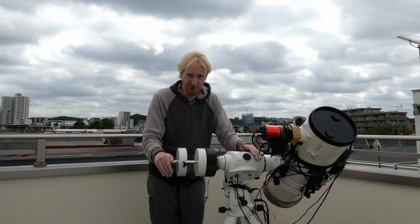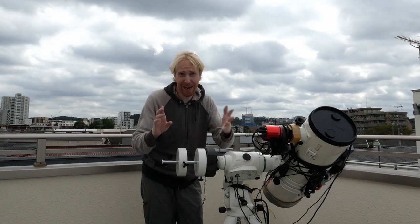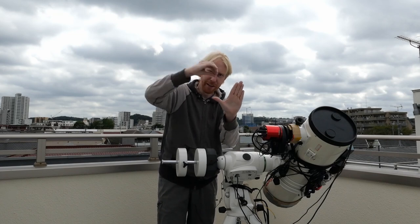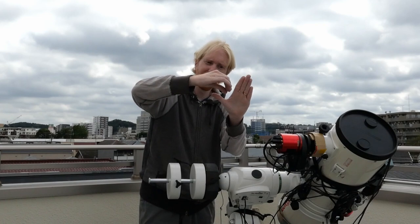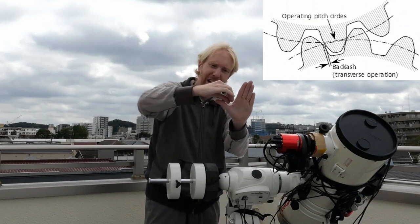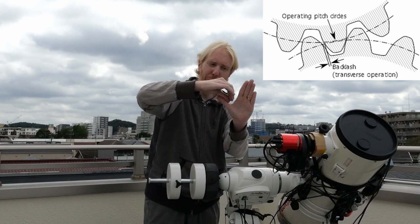Now what you may have heard, and you've probably heard that word a lot from me, is backlash. Backlash is when you have two gears. Let's say you have a tooth here that meshes into the hollow of a gear next to it, and they're not perfectly meshed, because if they're perfectly meshed, things get bound and nothing turns anymore. They're slightly unmeshed, which means that there's a bit of play there, which is called the backlash.